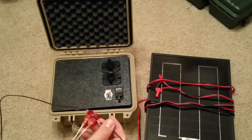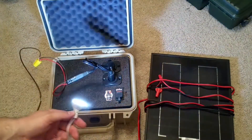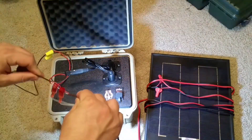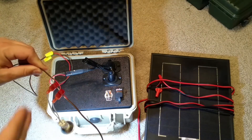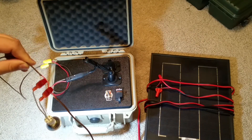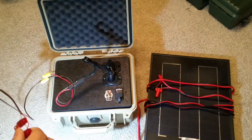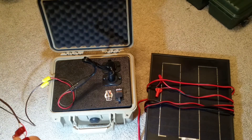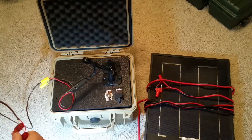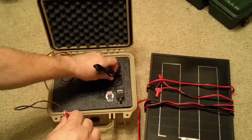So this is something I made and you can customize it as you wish. Let me show you how bright it is — you plug in the 12-volt, make sure it's connected, click it on, and there it is. It's real bright, actually. If you had several of these it makes quite a lot of light. You've illuminated your room, your living room, or your garage while you're trying to work or find supplies. At 2.5 watts per LED bulb, from my calculations this thing will run about 81 hours without needing to recharge off just the 12 amp-hour system. Fully loaded with all these lights running continuously, you'll get days and nights out of this system.